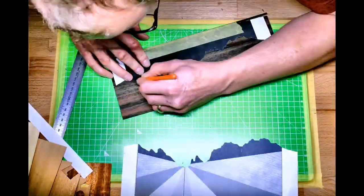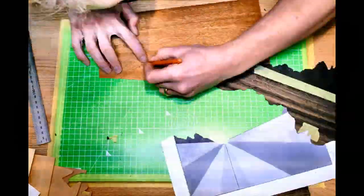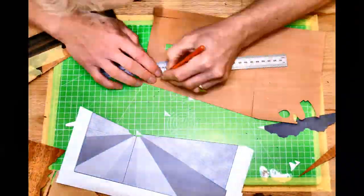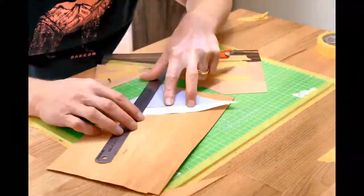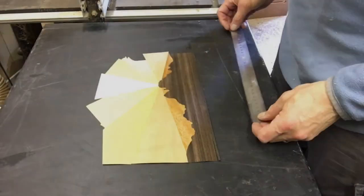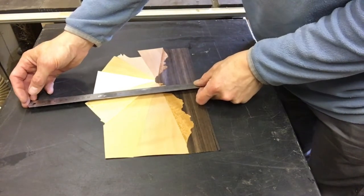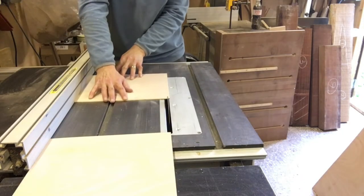The first stage is to prepare the marquetry for the lid. I drew a picture on a piece of paper showing where each veneer piece would go. I then chose different coloured veneers from light to dark for the sunburst behind the mountain. I used a very dark veneer for the silhouette skyline. I taped the drawing to the veneer and cut each piece out with a knife. I score each piece first and then go over each cut line over and over until the veneer separates. I taped the veneer pieces together using painters tape, which works really well as a low tack masking tape.